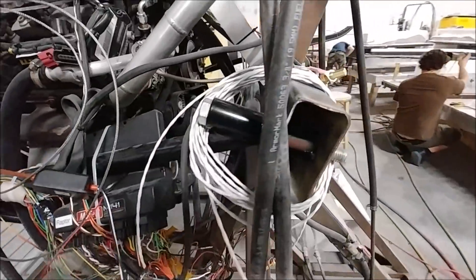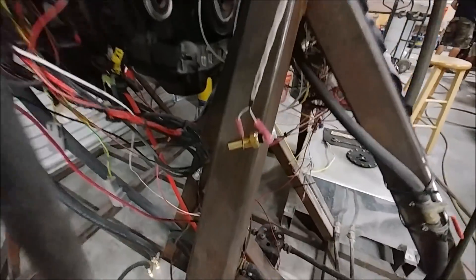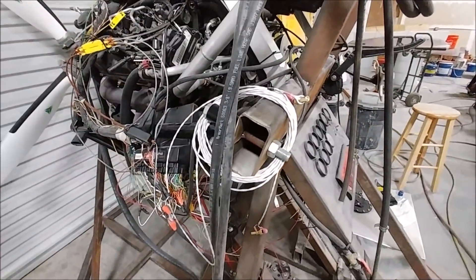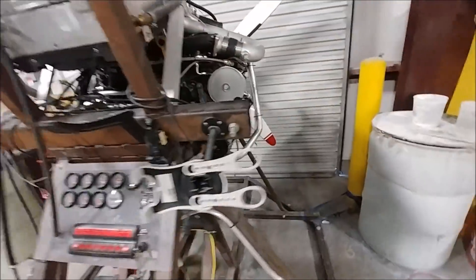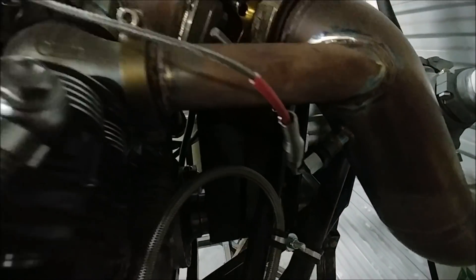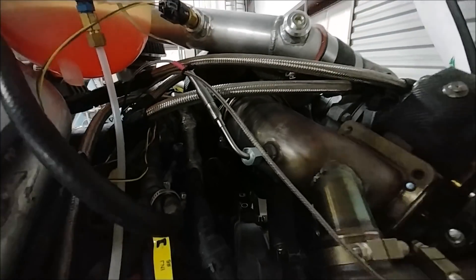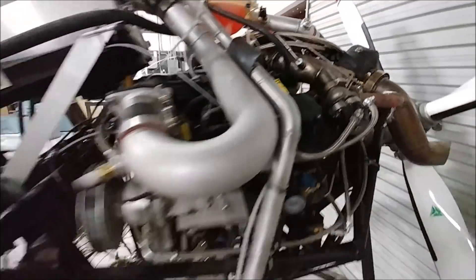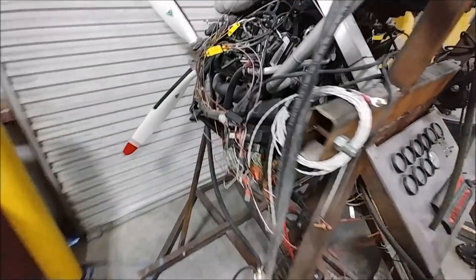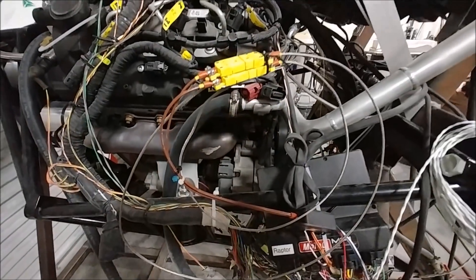I needed to get those sorted out, and also spent some time Monday wiring up both of these, because I got the resistors I was looking for. Those are the temperature senders that are going to go in the straight tanks so we know how much we're heating up the fuel. There's the new sensors for the EGTs, and I actually had to get Brit to come and weld on the new bungs, because when I was pulling out the fittings from the old bungs they stripped out. I believe I put some anti-seize in there but can't remember - anyway, problem solved.